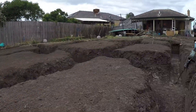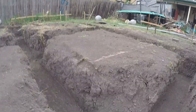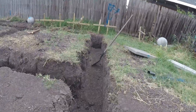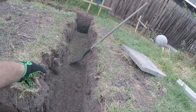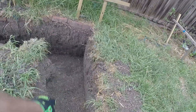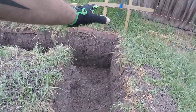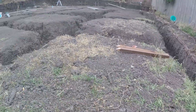The gradient of the whole property falls from the high spot in the top northwest corner down to the low spot in the southeast corner. Over here in the southeast corner, almost all of the property is fill — nobody really likes fill, it's not stable. There's no clay whatsoever, just topsoil all the way through. So we step down, cut across, the foundation work sits up about this high around this edge, all ties in nicely, and then there's a 150mm slab over the entire footing section.